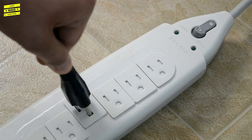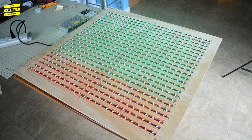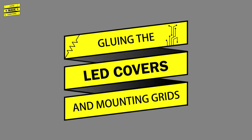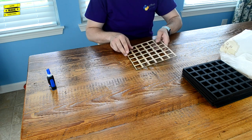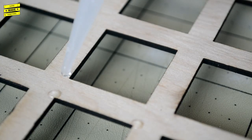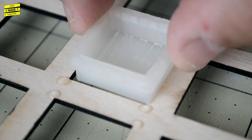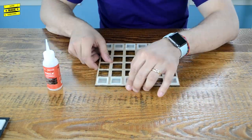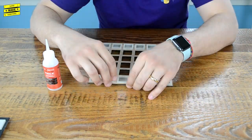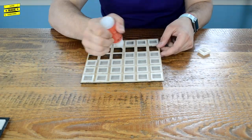After inserting the power supply's cord into a surge protector and flicking on the switch, the LEDs slowly lit up, indicating that everything was programmed correctly. At this point, all of the mirror's parts had finished printing, so I began gluing all of the LED covers into the mounting grid slots using superglue. I placed four drops of glue into the corners of each slot and gently pressed in each LED cover. This process can take a while, so be sure to work in a well-ventilated area, as the superglue gives off an odor when gluing in all 576 covers.